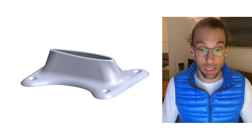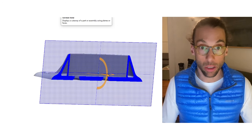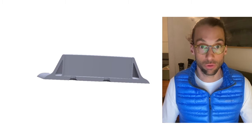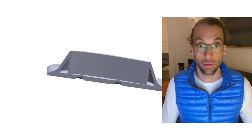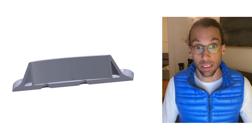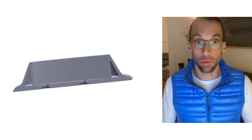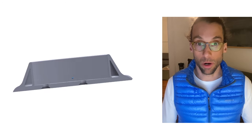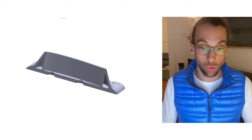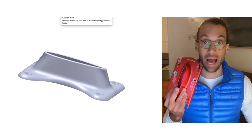Looking at the inside of this piece, it's completely hollowed out in order to shave some weight. This triangular profile goes all the way around to save weight. The two holes here match the standard 60mm aluminum mast — they are 60mm apart.